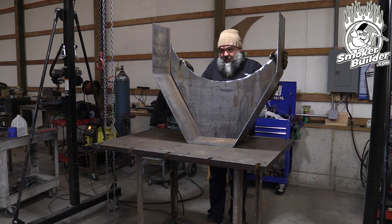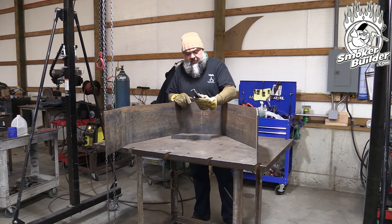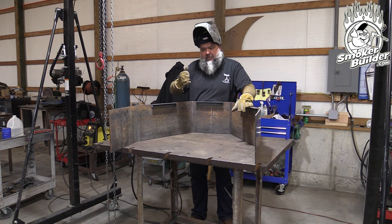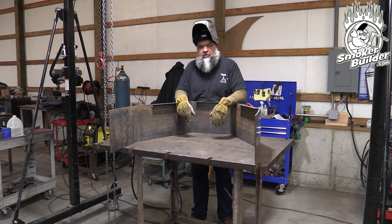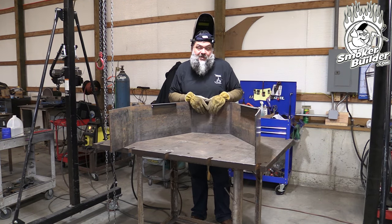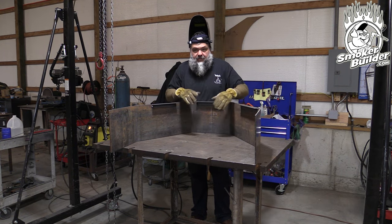The fabrication process involves cutting and fitting to hide mistakes from the material or the tape measure. We use a pipe clamp on the stout inch-and-a-half thick table to press out a bow in the edge and close the gap. We keep tacks off the transition area to preserve a clean weld there later. Once the skin is tack welded on, remove the temporary angle iron with pliers — we prefer to remove it rather than leave it inside, so there are no snags during cleaning that could hurt the operator.